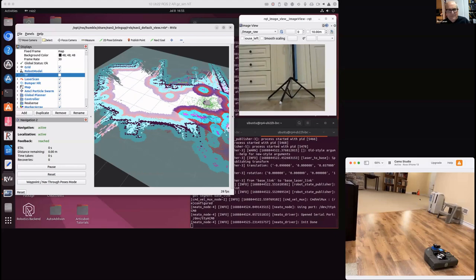You can sort of see it here. The purpose of RViz is to display various data visually that's useful for navigating around. So if I just turn this off, that turns off the map, the planner. The whole point of navigation is that the software plans where the robot is going to go, so it doesn't bump into things. The robot is here, over in the corner, and I'm just going to run it around the basement. This display is the image from the webcam that sits on the front of it. So if you want it to go somewhere, you give it a goal.